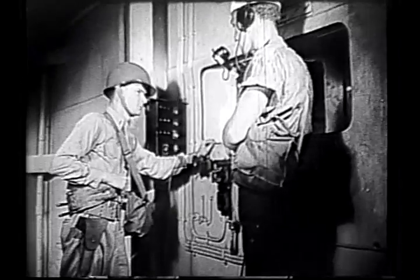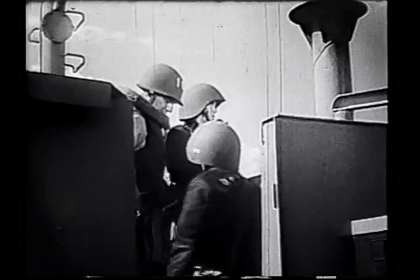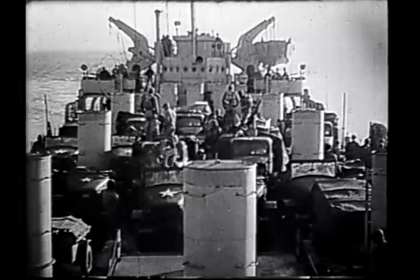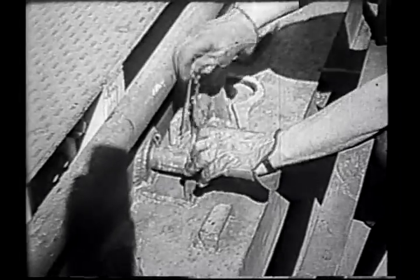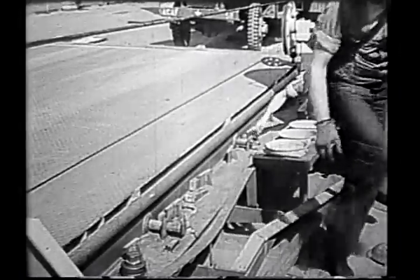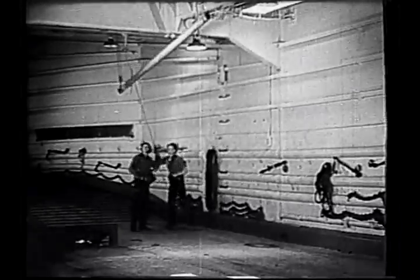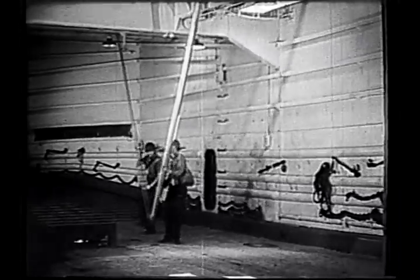When the last tank has disembarked, the report, "Tank deck clear," is made to con. The order for unloading the main deck is signaled by holding both arms over the head. The elevator pins are removed from their sockets, releasing the elevator from its housing. The elevator guides, stowed along the overhead of the tank deck, must be shipped before the elevator can be operated.